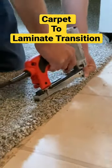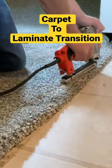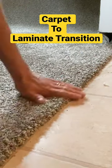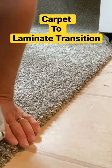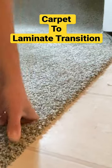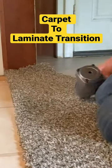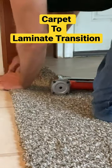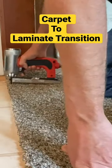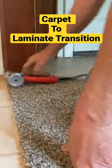This is totally a slop and pop type deal, but for DIY types looking for a fast way to transition carpet to an existing floor, this is an easy way to do it. You may be thinking — what about that little bump you're creating? You're going to stretch the carpet opposite of that flooring to get it nice and tight, and that'll flatten any potential bumps out. I'll show a couple more scenarios for transitioning carpet to vinyl plank flooring so you can handle these installs just like a pro.